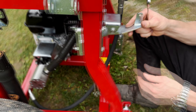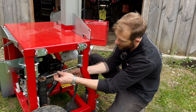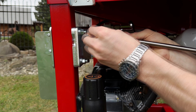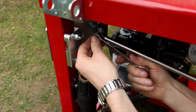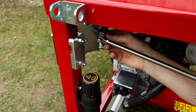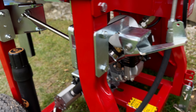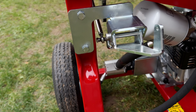Now that is a tight assembly. From there we can swing this forward — which is why we do this joint first, because in the operating position it's hard to get to. Then go ahead and do the second eye: same thing, swivel, insert your bolts, tighten the bolt into the bracket, install the nut on the back side. Now you can see we have a nice tight control — there's no slop or play in it and this section is all tight.